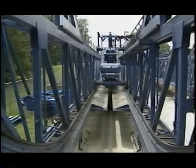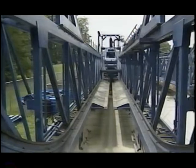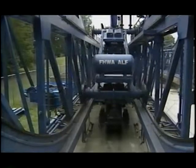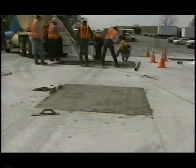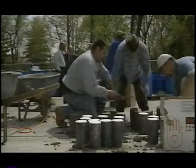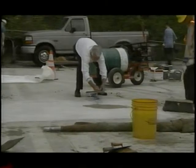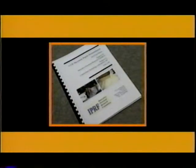By the end of testing, the repaired sections had been subjected to over 400,000 repetitions of 24,000 pound axle loading. This was well above the original design life of the test sections. Even though there was some cracking, the repairs performed well and extended the life of the original pavement. It appears that UTW panel removal and replacement using the evaluated procedure can be an effective UTW repair method. Additional technical details for repair of UTW are provided by a companion tech brief published jointly by the Federal Highway Administration and Innovative Pavement Research Foundation.